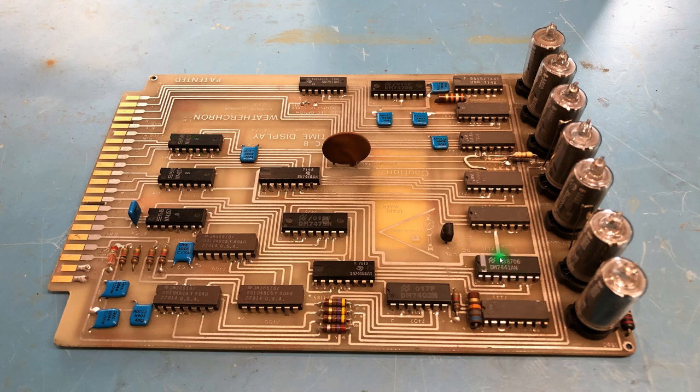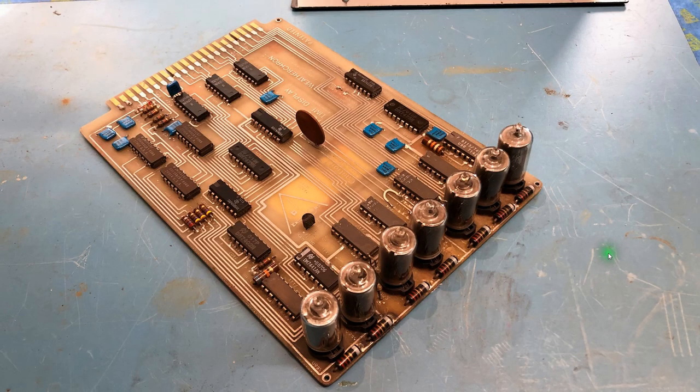I think we can ignore this device — it's a replacement, and I suspect another one might be a replacement as well. Some of these markings appear to be date codes but aren't. There are 7400s here — these National devices in ceramic packages — and I believe the JM marking indicates military grade. They've used copper on the board to label devices like 7402 and 7400.